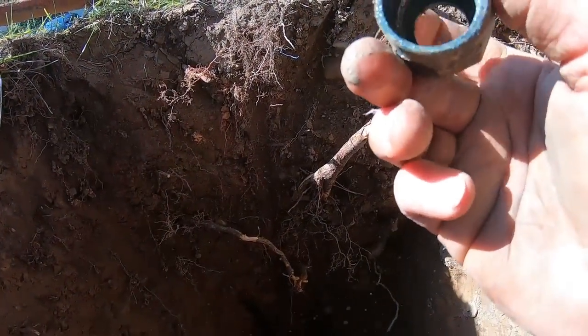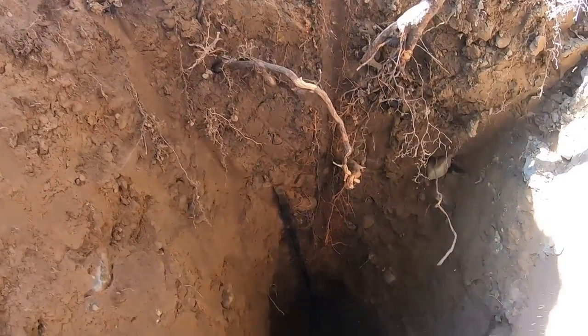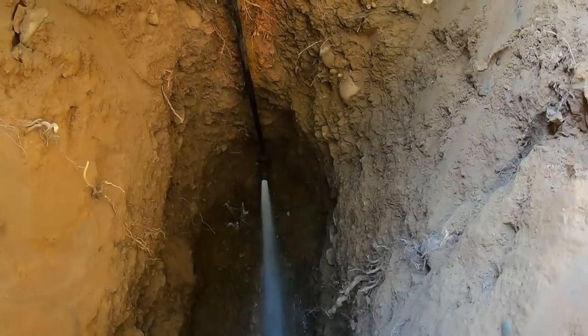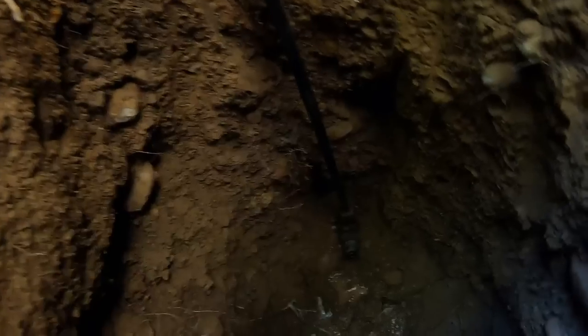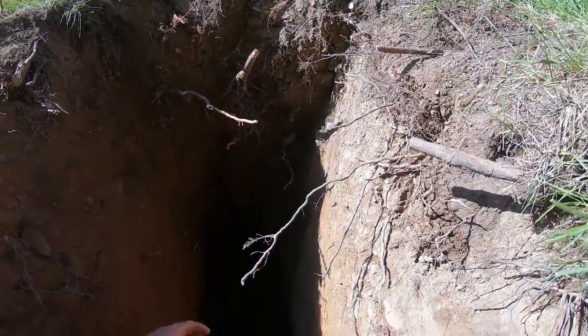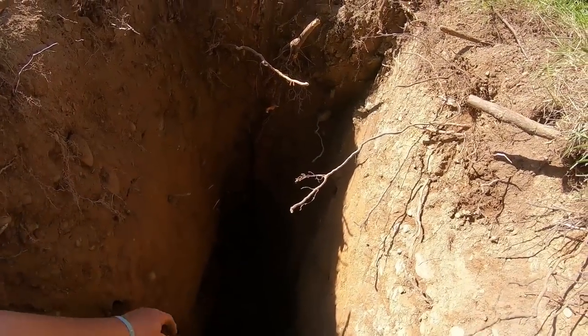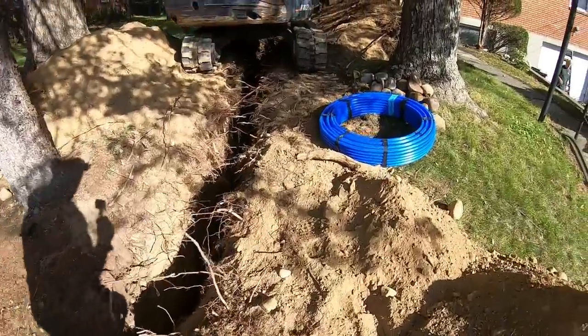Looking good. Inspect it — the water department will give you a new one if it's not good. Everything looks fine; turn on the water and that'll clean it up. Depending on how long these curb boxes sit, that cotter pin right here can go bad. It's hard to see in the trench, but there's a cotter pin in there. If it comes up off in your hand, the cotter pin's bad — put a new one in, and make sure it's stainless steel or it will rot out. That nut down there is an inch and five-eighths — wait and grab my wrench.